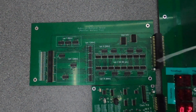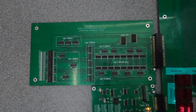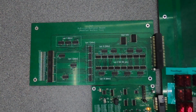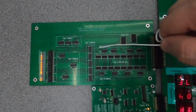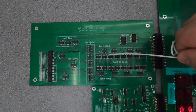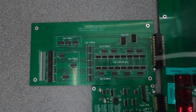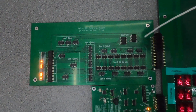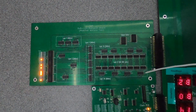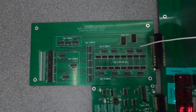So what we do at each level, we pick 4 bits from one set of AND gates, or possibly even from different AND gates, it doesn't matter. We pick another 4 bits that are in the same positions in the output, and we use an adder chip like this one. These are the first level of adders. We use these adder chips to add them up. And fairly obviously, this adder probably takes its input from these two mostly, and this adder takes its inputs from these two mostly, but there are traces that run all around here to get signals to where they need to be. It's not quite as simple as just coming next to each other. The adders also get a carry in, so it's actually a 5-bit input to each of these adders, and there's a carry out, so it's a 5-bit output. So 5 bits plus 4 bits in, 5 bits out.